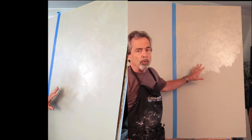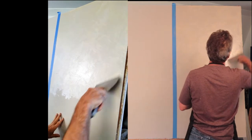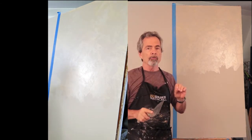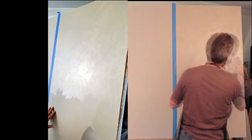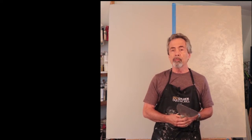Make sure you complete one section before moving on to the next, and clean off all your excess before moving on. If you let the glazing gel dry too long it'll start to tear. Your best bet is to let it go ahead and dry for about 30 minutes, then go back in and fill in any spots you might have missed. I'll let this set up for about 20 minutes and then go back in to fill in any areas I might have missed.